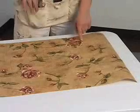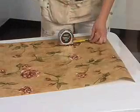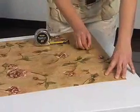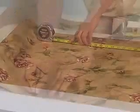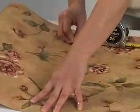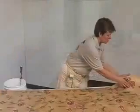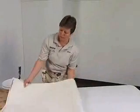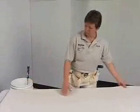Find a pattern you want to put at the ceiling line. Add 2 inches at the top and cut your sheet to your wall height, adding 2 inches at the bottom as well. This will give you some play should your room not be square. Cut 3 sheets and lay them face down on your table with the top near your paste or water bucket.